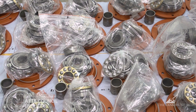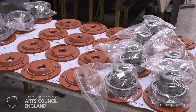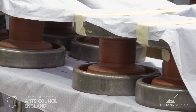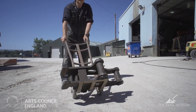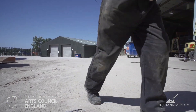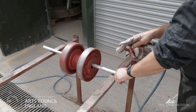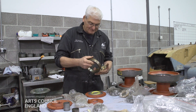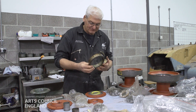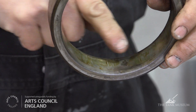As you can see on the table there are lots and lots of components. These are all kept in bearing sets from the original because you have to use the original spacers that have to go back in to match the wheel they came from. So we've done a lot of cleaning, a lot of shot-blasting, a lot of new components. That's a typical one of the main roller bearings - this one has got corrosion in the thrust race, so that needs replacing.